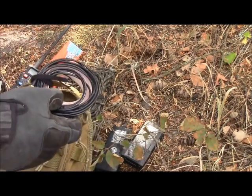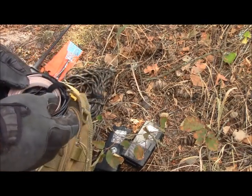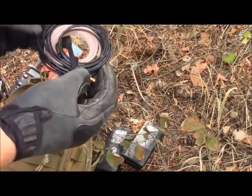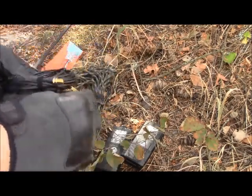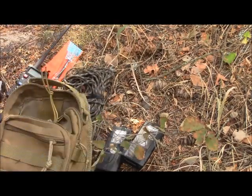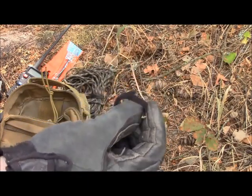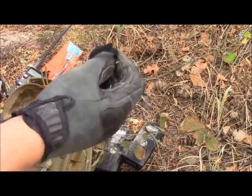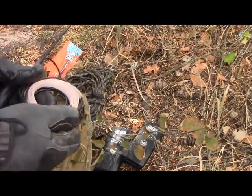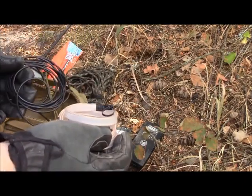This right here is something you don't want any communications kit to be without for your HT — your handheld radio. These radios are limited to 5 watts, and there are newer higher-power radios that go up to 8 watts with multiple tri-power. But when you add a roll-up J-Pole antenna, this will increase the gain. Elevate it up into a tree and that does even better for you. Something else that should be in every go-bag kit: roll-up Velcro-type straps — you can buy these in a pack of about 30 at Lowe's on a roll and just peel off what you need. This is a Nelson dual-band J-Pole roll-up antenna, available on eBay for about $27 with shipping. These are amazing little roll-up J-Pole antennas and will really increase your range.